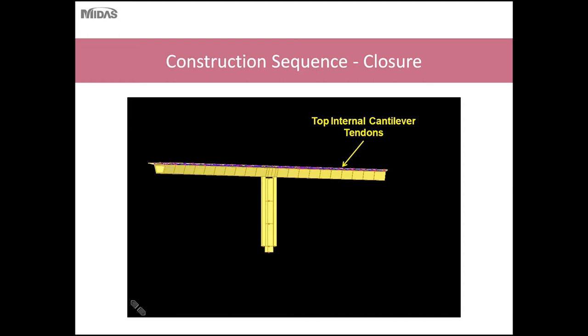As segments are erected, you will have to apply an epoxy coating to join the two segments for durability, to prevent water from getting in the segments, and to join the two segments together more effectively.